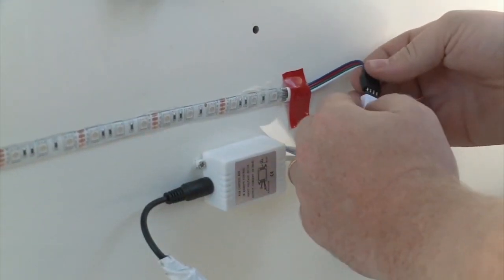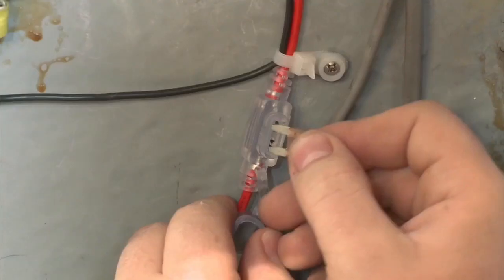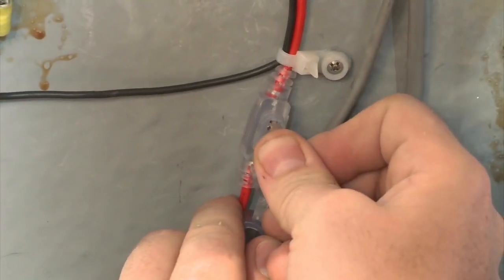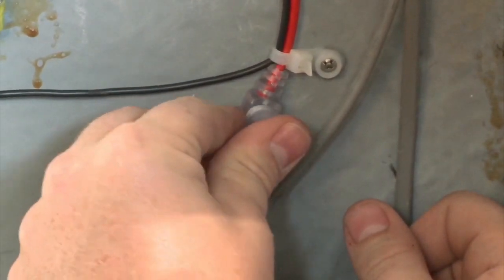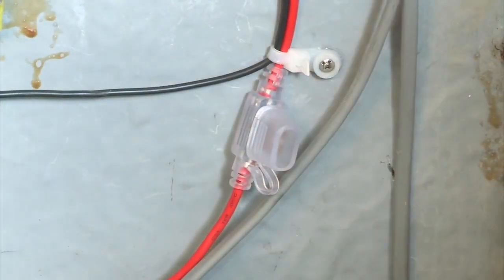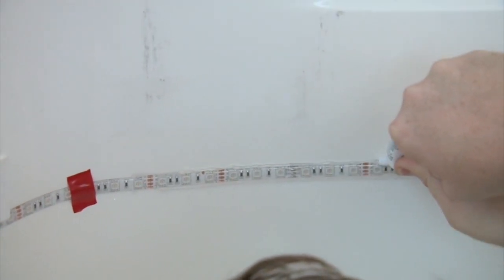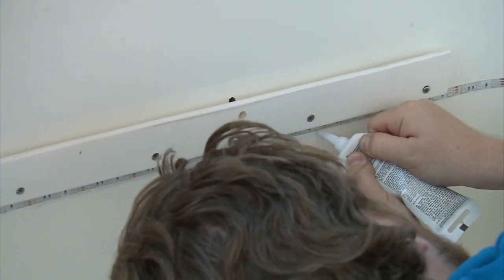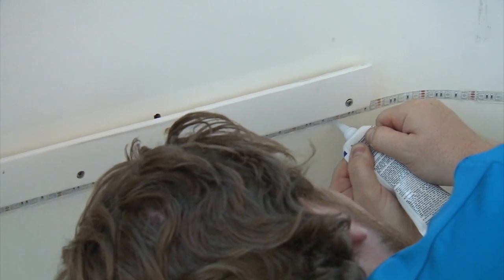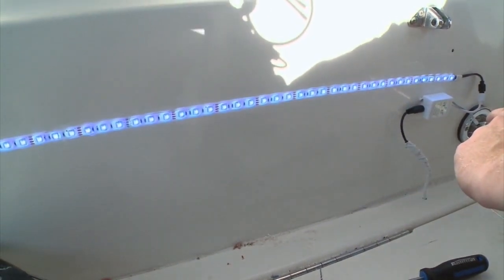Plug in your power connection and connect to the strand itself, using the arrows to line up the right way to connect. Once everything is all connected, crimped, and covered with shrink tubing, you can pop in one of the mini 5-amp fuses to complete the circuit. Now that you're wired in, if you're 100% happy with where your light strands are, run a thin strip of silicone along the top and bottom for some extra stick and extra protection when you're hosing off the walls and floors. Once that all dries, all that's left is testing it out — success!